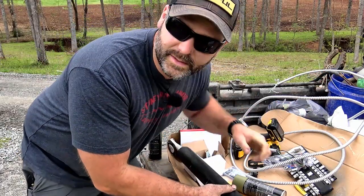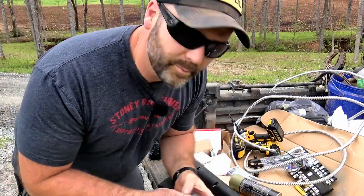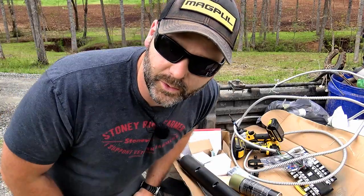This will handle up to a 16-foot farm gate just like what we have right here, and it comes with a little remote. We're going to use a solar panel since we don't have power ran to it. I overbuilt the post and the gate opener a little bit — I'm using a 12-volt marine gel battery versus the small battery Mighty Mule makes. The marine battery will last and last, and it can drain all the way down and be charged all the way back up without damage, unlike a regular car battery.